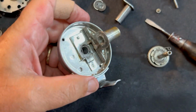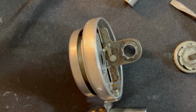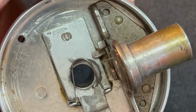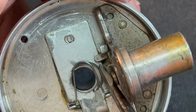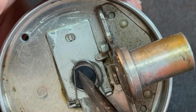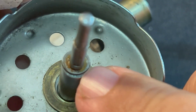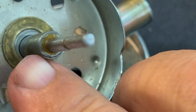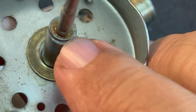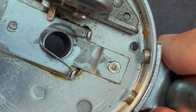Okay, as a matter of fact, I'm going to set it down low, and we are going to use the zoom in feature to get in there close to it so you can see it. And I had to get this just exactly right so that it wasn't on the axle here, so it wouldn't fall back into the groove, and yet it rides in the groove, but then as it goes around, as it gets into this groove right here, that groove pushes it out and pops it over. Now, as soon as you push it out, it comes up, it drops onto here, and then it starts to rotate around again, and that pushes it out again. Okay? That's how this works.